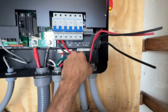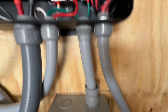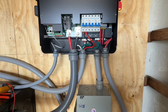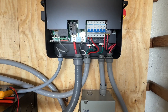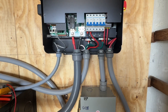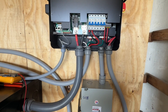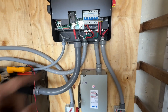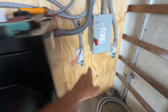I got this side done and I left slack here and everywhere else — because if something goes wrong down the road and you have to cut off a piece of wire and re-insert it and you're an inch short, you'll be kicking yourself, because then you've got to undo all this and run wire through that conduit again. So leave a little extra slack every time. That side's done; I just have to do this one now.